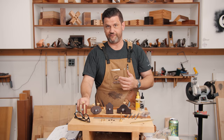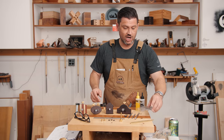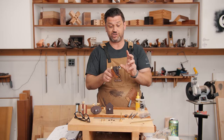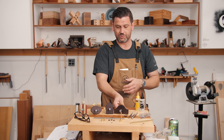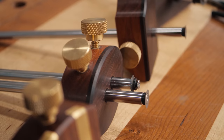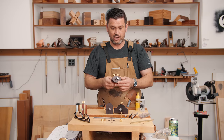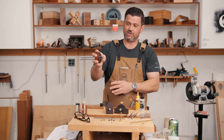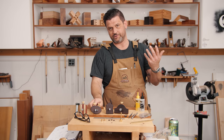It certainly is beautiful. You can get cutter heads for a mortising gauge — a mortising gauge is going to have two cutter heads on it, so you can set them a certain distance apart and then a certain distance from an edge. It comes with a lock knob, which is really helpful if you're doing a bunch of mortise and tenons. You can put two rods in one, which functions as two separate measurements — set them at different lengths and use it one way, then flip it over for two measurements. There are tons of options, and all those templates are available in the free step-by-step guide.